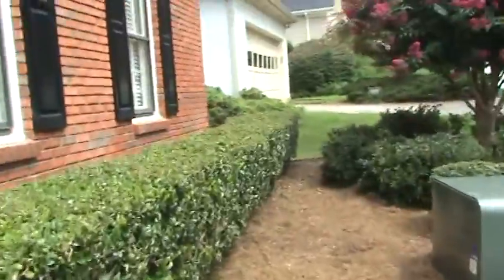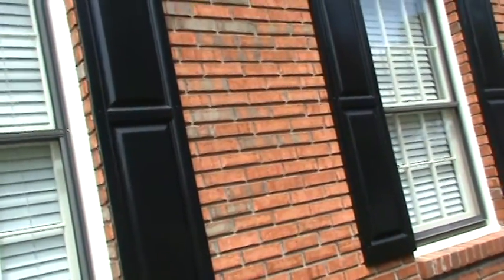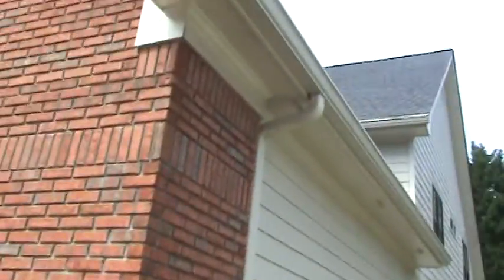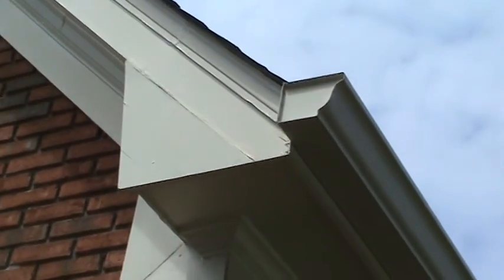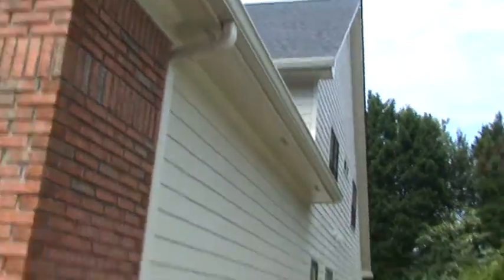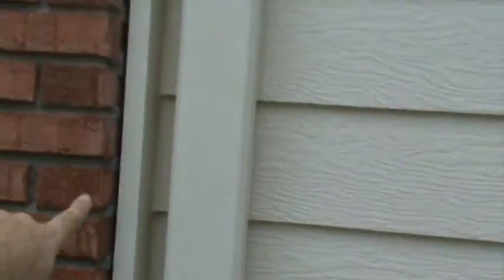There's a little bit of rot all the way around, but the front of the house is in pretty good shape. The customer wants us to paint the underlying windows, so we'll remove the storm windows, label them, stack them in the back, and reinstall as we go. We may find more rot as the project progresses — that's typical. This is Masonite siding or Georgia-Pacific siding. It's not inherently defective as everybody says. This corner has never been properly filled and caulked. As you come down the siding, you'll see the thicknesses are pretty tight, and any waviness is from the framing, not the siding.